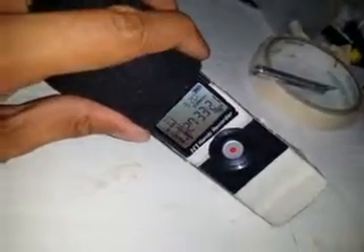I placed a single AA battery and it will just display. The card can now be accessed. Before, this was just 35 seconds of recording time; now it's 27 hours. The only problem is I can't remove the SD card because it's permanently soldered in with the wire, so I just need to connect this to a PC using the mini USB port and I'm good to go. Everything works fine.